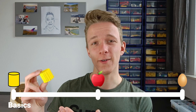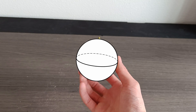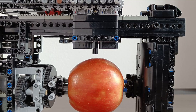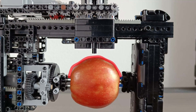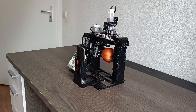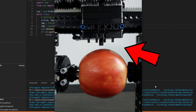This is not an apple, and that is where the problems really start. You see, apples aren't cylindrical, spherical, or really any kind of predictable shape. Instead they are organic, so we need some way to see what the exact contours are so that we can always cut at the same depth. And if you know me, you probably also know where I'm going — cameras. We're going to use a camera to look at the apple. If we simply put a phone right in front of the cutting section, we can clearly distinguish the apple from the background since the background is white and the apple is red. Let's just run the working code and I'll explain it as we go.